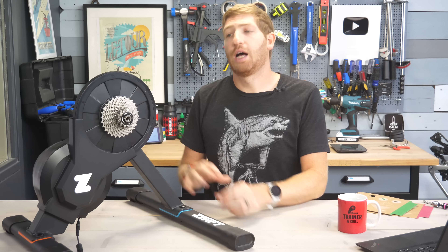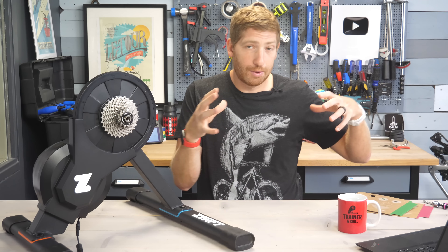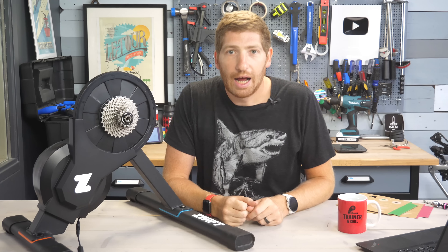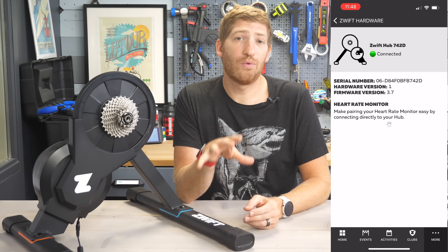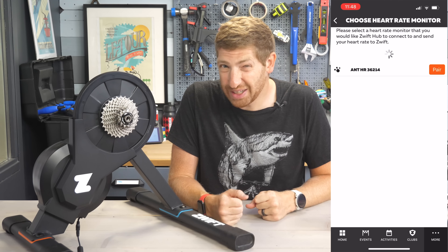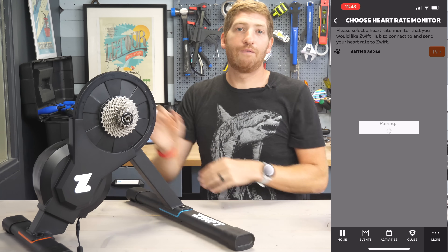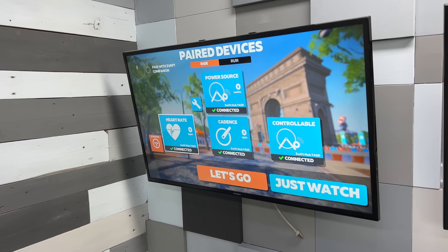The last area of change is around the firmware. It now broadcasts itself as the Zwift Hub trainer and connects via the companion app. Within the app you can update the firmware and set up the heart rate pass-through. The idea behind the heart rate pass-through is that if you have a heart rate strap and want to use steering on Apple TV — which only allows two concurrent Bluetooth Smart connections plus the Apple TV remote — you'd normally be out of connections. So the trainer pairs to the heart rate strap and funnels that data up to Zwift as one channel: power, cadence, trainer control, and heart rate all in one, leaving one extra channel free for steering.